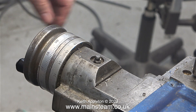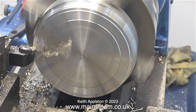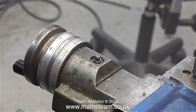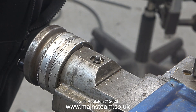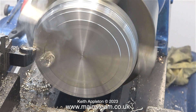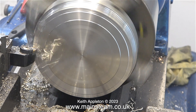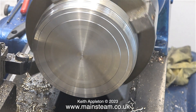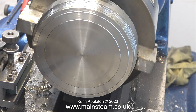I have two back gear speeds: slow and fast. This is the faster back gear speed, and here is the power cross feed speed — this seems to be about right. It's removing metal, the lathe isn't being strained, and the part isn't getting too hot because it's not making as much smoke. I don't use industrial coolant or soluble oil, and yes I know you can buy soluble oil that isn't as smelly as some brands, but I've never needed to use any in my workshop.